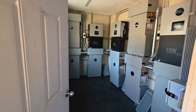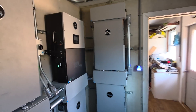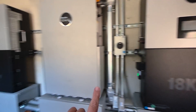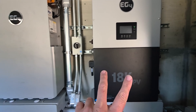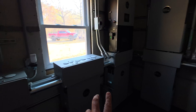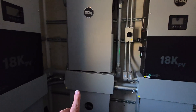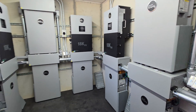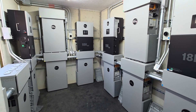Or why do I have so many batteries and inverters? I currently have four 18K PVs, and each one handles two strings of 10 panels, so they're all balanced evenly with the inputs. Each one has its own three batteries that it's supported by, although those batteries are part of a continuous bank. There are 12 batteries and four 18K PVs total.